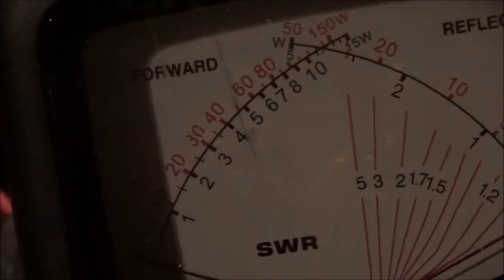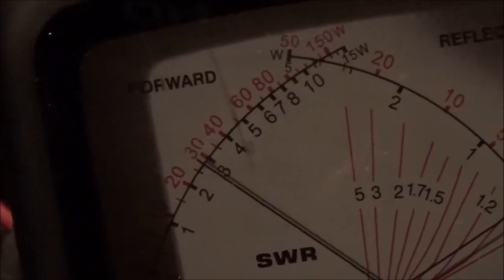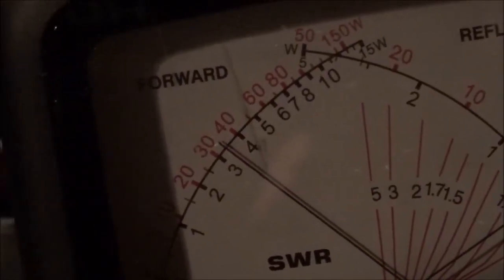And on the other end of the spectrum, you can custom tailor all of your other settings the same way. I had the 10 watt, I think I left it the same, so let's see here what we got. Got it about 15 watts right there, as you can see. Low 3 should be about 30. Yeah, it's pretty close, about 28, 29 watts. High power, like I said, the top end went bad on the radio, so it's only showing about 35 here, so excuse me anyways.